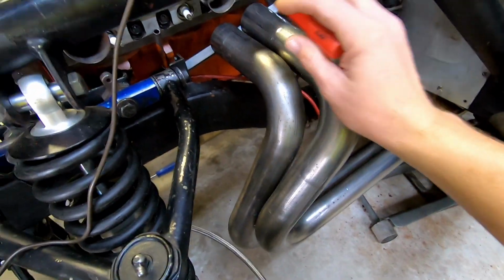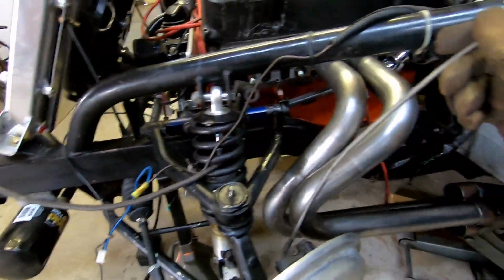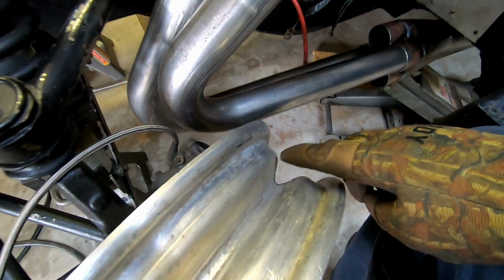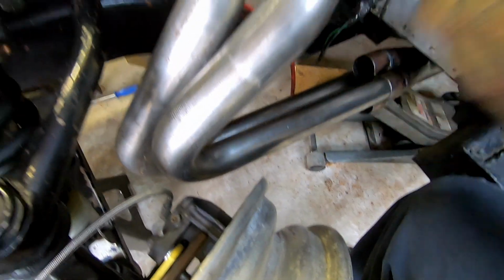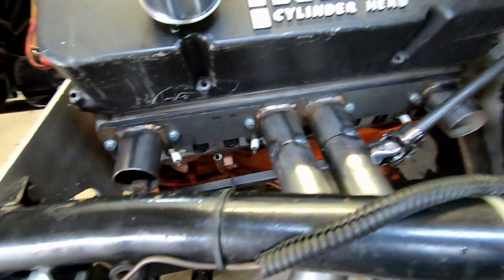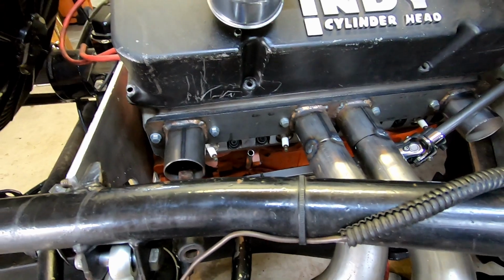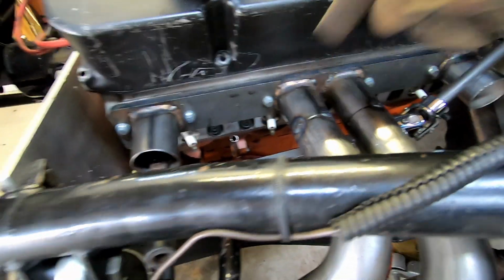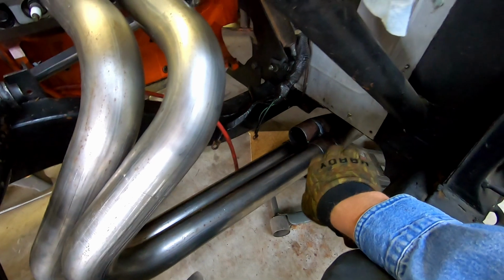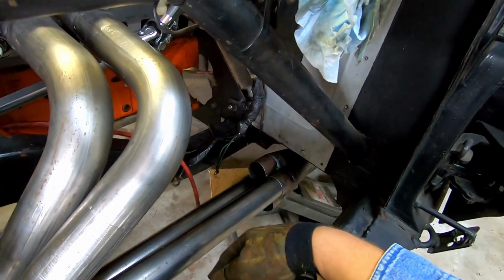I'm going to mark these two up. We got to trim them some and bring the whole thing in. So what we have here, the brake line goes over there. I could line them all up and do all that, but when the tire would be on this wheel, it'd be too close. So this tube is getting modified. This one, they both lined up real nice, but we're going to leave this one permanent, so it won't have a bunch of breaks in it. It'll support the collector. Collector's got beautiful space around it. It's centered in the opening. It's flat, parallel with the ground.